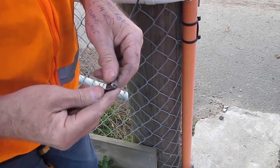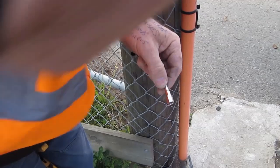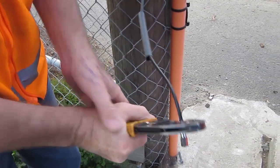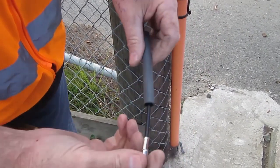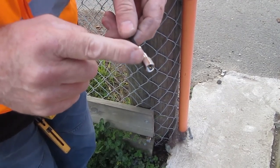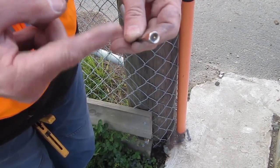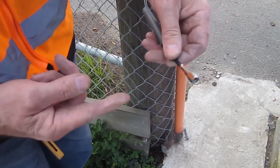That pin should be right flush with the end of this connector — then crimp the outer up. Now we've got a little bit of heat shrink here, and this is vitally important: these two connectors are going to be outside and they're not waterproof, so you actually need to waterproof them. If you use these connectors and leave them outside for water to get in, again you're on a hiding to nothing. Anyway, let's do the other side.